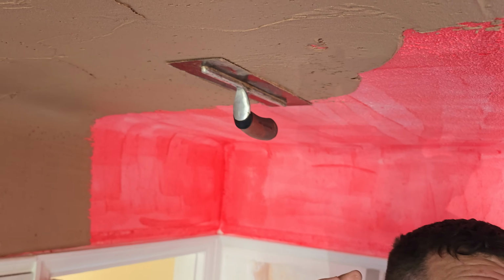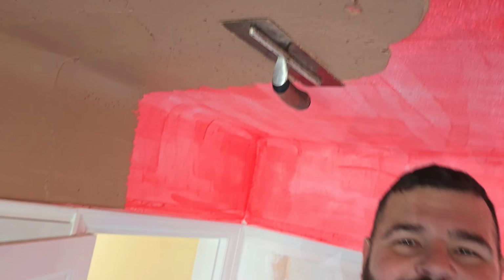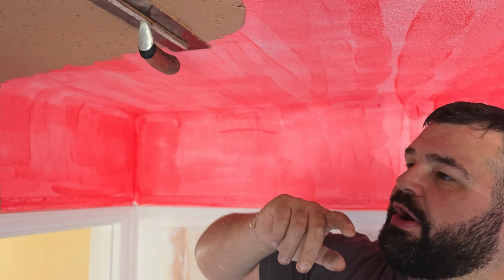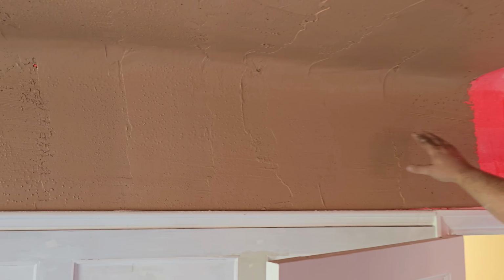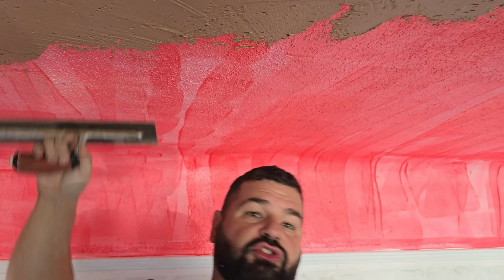Listen. Can you hear that? Like snap, crackle and pop. Show me, look, the bubbling. Don't worry about that, okay? You get a bit of bubbling coming through. It doesn't matter, it's just the plaster reacting. Now what can happen is, look, it's all here. This will end up coming through the second coat, and you might even still see it when you trowel up. But towards the end of the mix, when you're polishing, they'll definitely be gone by then. So don't panic about them, thinking you've got to go round getting rid of all the bubbles. Just carry on as if they're not there.